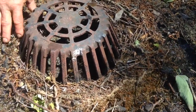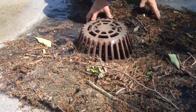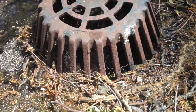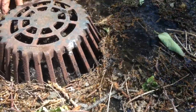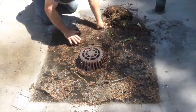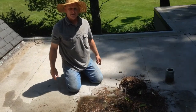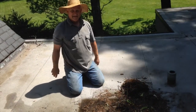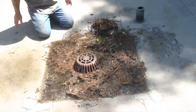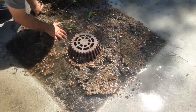You can see a little bit of water sitting here. So when the owner comes and maintains his roof, he just removes the debris — remove it — and there your drain is draining again. That's what you're supposed to do: remove all the debris around it, and this recessed area will collect the debris again until you get a chance to come and clean your roof. Perfect drain, ten years ago, the roof is still perfect. Alright, turn it off and then move the drain.